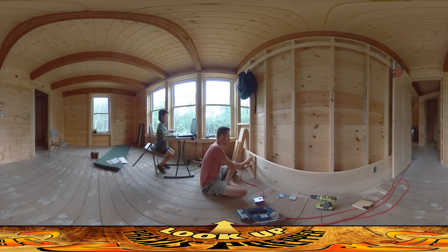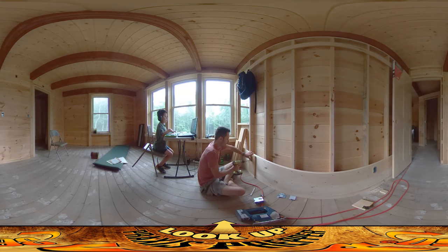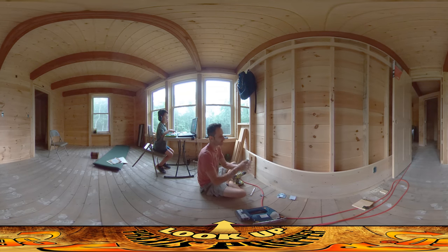So I'm putting that in place, take the pencil, just kind of run around the inside there. For those little bump areas we're using the drill. I'm going to drill one corner here, one corner here, and then the top and the bottom need a little bit of a hole too — once you attach the outlet a screw has to go through there, so you need clearance for that.